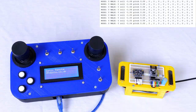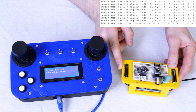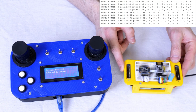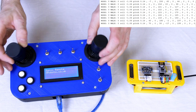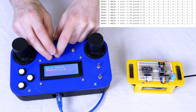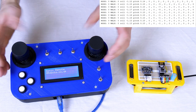So now we should be able to get that remote data. For the electronics back in the box, we've got a power supply smoothing capacitor and a decoupling capacitor because those NRF chips sometimes have problems with power supply issues. We can see the IMU data is still working, and we've also now got all our controls working, including some switches I can toggle that should be giving us some digital bits on the end there. So that seems to be working all right.